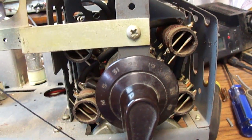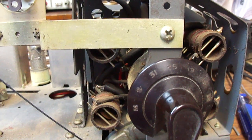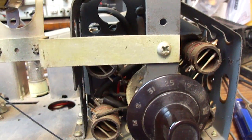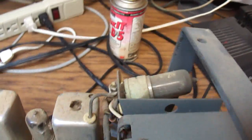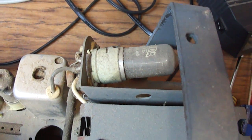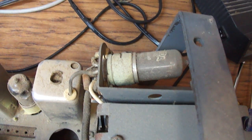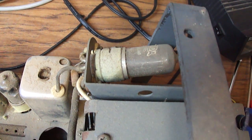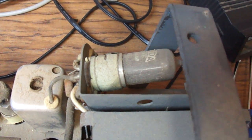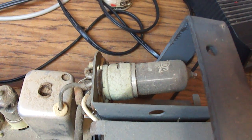Here are the RF coils — though it doesn't actually have an RF amplifier. It has a converter tube mounted up on this little pedestal. These are British Mazda valves using a British 8-pin socket. It looks like it would be an American 9-pin tube — the bulb looks the same — but the socket is totally different.